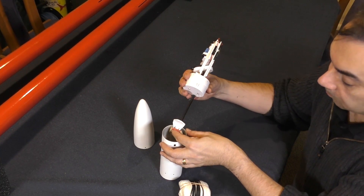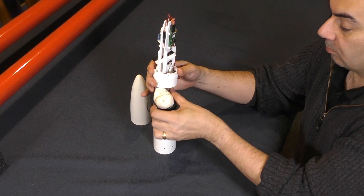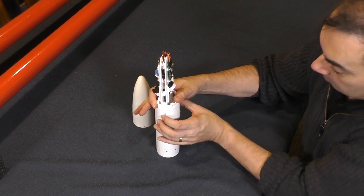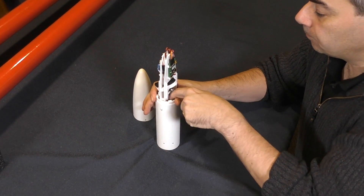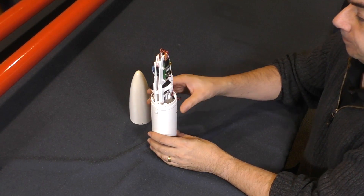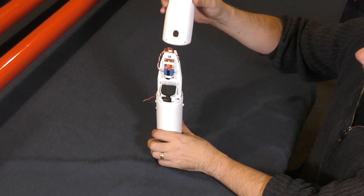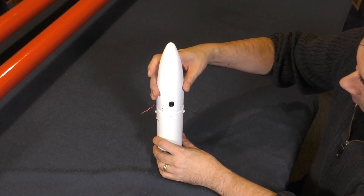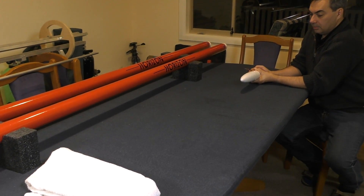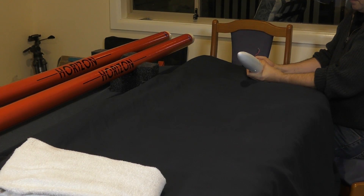Here is how it goes together. We first put the rubber band on the ejector plate and then put the parachute in, then press the whole thing down until the levers pop out of the sides. Then we turn it on and lock the levers in place. The nose cone then gets put on top. You can see that the system is armed because the LED shines through the nose cone. On the actual rocket the parachute short cord is attached to the rocket as well as the nose cone.